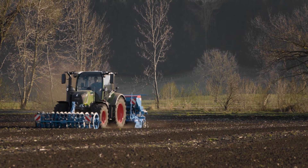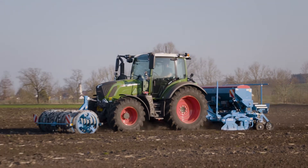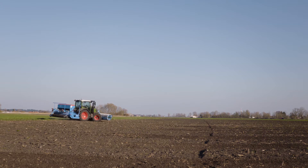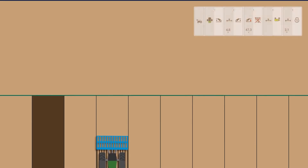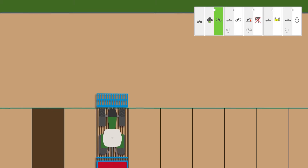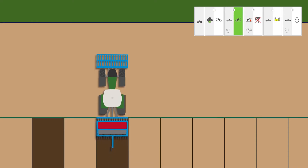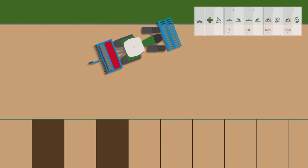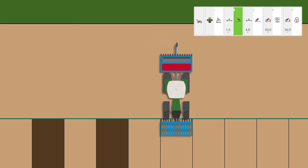At the headland, you need either maximum concentration or Fendt TI Headland. This automatic headland management system enables the tractor to trigger the saved sequence itself, all on track with the headland line. When extending, the end sequence is triggered when the front packer reaches the headland line, and each step of the sequence then follows automatically. As a result, the work process is always stopped or started at precisely the same point. When retracting, the start sequence is already triggered at a preset distance before the headland line.